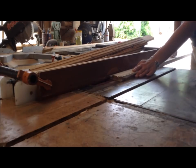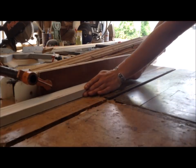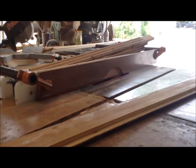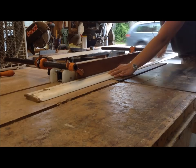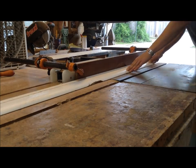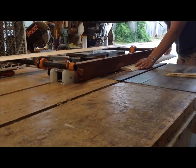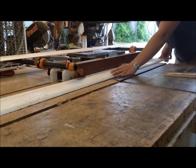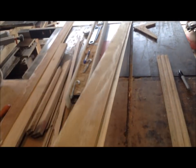I have a sacrificial fence attached to my real fence on my table saw with a dado stack, and I'm ripping rabbets into the edges of these moldings. Standard rabbet width for picture frames is about a quarter of an inch. I made mine a little bit wider, and the depth I kind of just eyeballed based on the thickness of the moldings because they're not standard — so these were about three-eighths inch to a half inch deep.